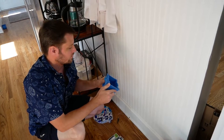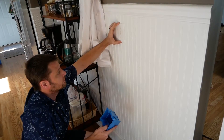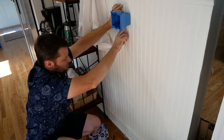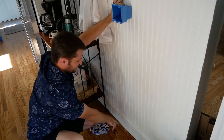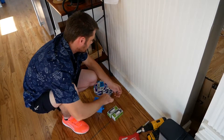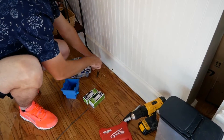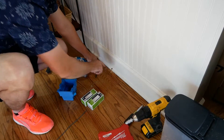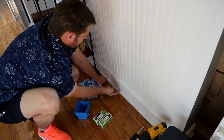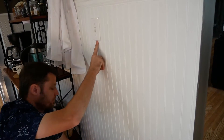I've got this old work electrical box here, two gang, so I'll take the single one out and put this in here so I can put two different switches. Now in order to get the wire to come up through the wall, I have to find out where this runs into the basement. So I'll drill a little hole here into the base and stick a piece of wire down in here. Then I can go in the basement and see where that goes, and I'll drill an additional hole about an inch and a half behind this that will go up through the stud and into this bay.